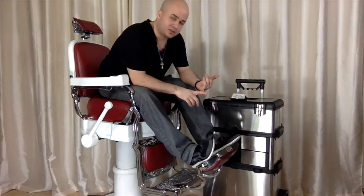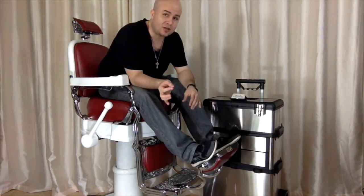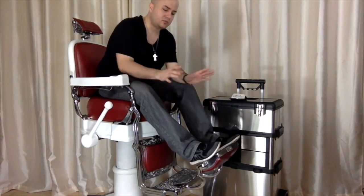So now you're ready to put the chair back together. You have all your parts ready. The porcelain is done or cleaned, the upholstery has been redone, your chrome or nickel plating has been redone, and your pump has been rebuilt. Once you start putting your chair back together, remember the process is the same way as you broke it down. Make sure you go over the video when you were recording yourself taking it apart, so you know where those pieces, nuts, and bolts go back together.